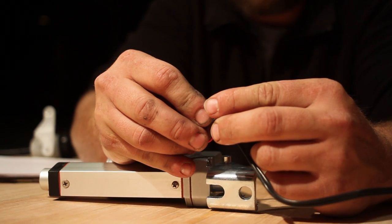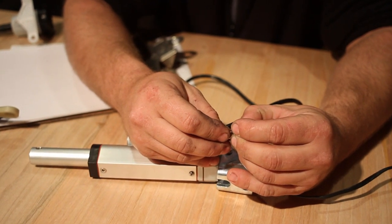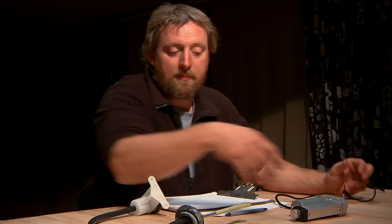The clutch is not a stock part of this car and we don't want a clutch pedal. With an electric car you hit the gas and it moves — you don't have an idle. So we can let the clutch out, put it in first gear, and just hit the gas and you're moving. When you go to shift into the next gear, you hit a button on the stick shift and it actuates a linear actuator to push the clutch pedal and allow you to shift. You shift, then it sucks back in and you're in your next gear.